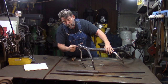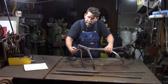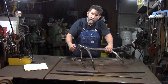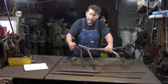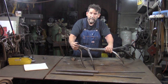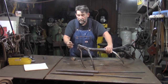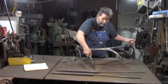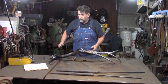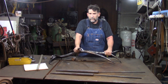And then we want to weld up, kind of crown this end, and then we take the welder and we go around here and we build up just a ring around here, probably about 1/2 inch high. Once we get that ring welded up all the way around, then we just take and real quick we run the MIG to give it this boss. That's how we do the boss, okay? Once we get that done, we stamp our name in it, our initials, and we have our shed.